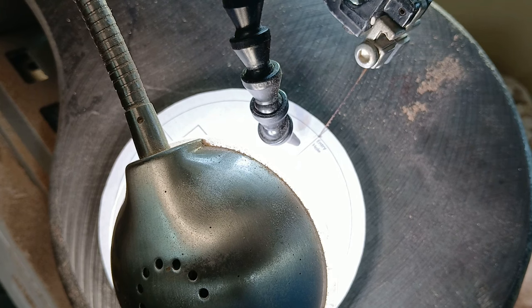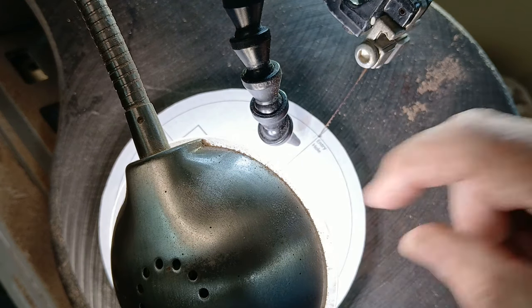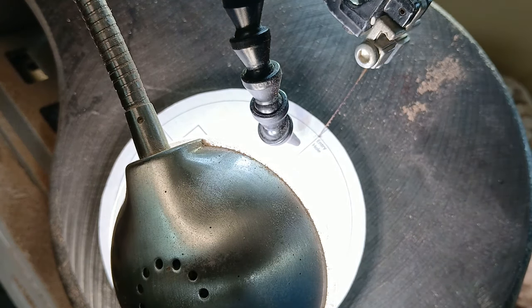But the only problem I've had so far is the drill bit flexed in two of the holes. That bubinga is pretty dense. Even the ash is dense, but when the bit hits a different density, it wants to move a little bit because it's a very small bit. And in one of them I came into the drill hole a little bit off, which leaves me some stuff to sand off, but I've cleaned up worse than that. So we cut this last one, and then I'll match up the rings and glue them, and we'll start the sanding process.